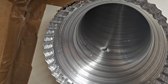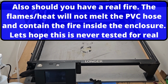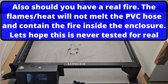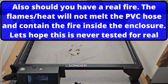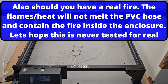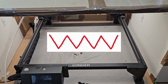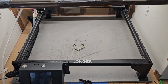I would buy the smooth bore stuff. Don't buy the plastic stuff, or the plastic stuff which is aluminium lined. You want the smooth bore hose, because it's just like your garden hose. You've got lots of water coming out your tap by your kitchen. You put your garden hose on, you run it down your garden, and it doesn't come out very hard. You have to squeeze the hose to make it spray. Exactly the same. It's resistant. So we've got resistance of the air traveling through the duct in the first example. Now we haven't got it, and you saw by the meter what difference I'm getting.